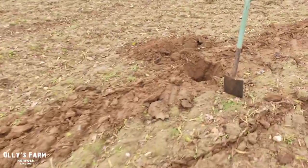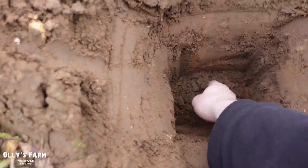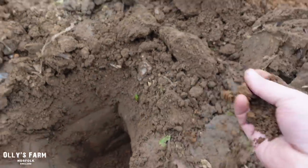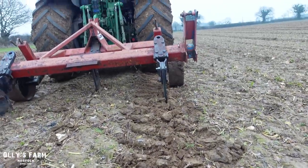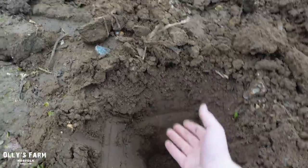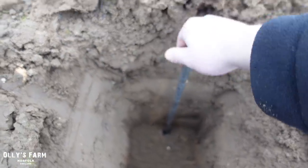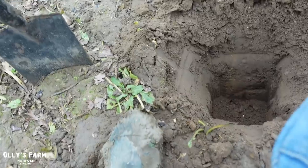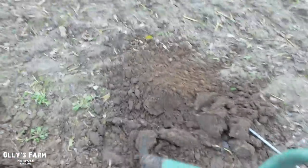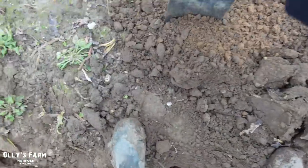I've just dug a hole to try and work out where the compaction is and what sort of a job we're doing. These first layers are pretty compacted. I'd say it's compacted all the way down actually until we reach this sandy layer, which goes quite gravelly if we start digging deeper down. I don't want to go into the gravel because that's going to cause more problems. There's a fine line between going too deep and doing the job we need to do with the compaction layer. We really just want to be going down about the width of this metal bar which I brought with me - it's literally the width of the bar. This is an 11-inch bar, and 11 inches is where the compaction is. So if we compensate another 2 inches, which is 13 inches - which is what I've got it set up on - that should be fine. It's a difficult compromise.